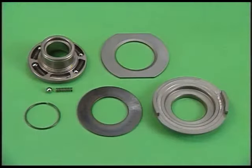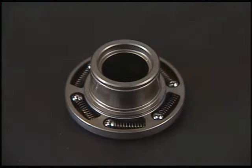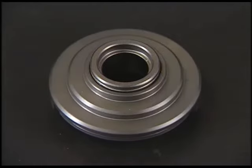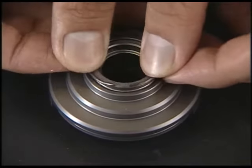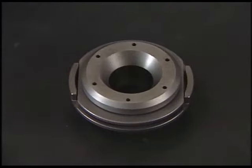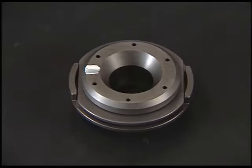It's possible to disassemble the rotator into the body, ball plate, Belleville spring, and spring shoe by removing the circlip. Wash the disassembled parts with washing oil. Check if there are no abrasions or corrosion in each part after cleaning. If there are any damaged parts, replace them. At this time, mark on the rotator so that it is easy to check the revolution work during a run.